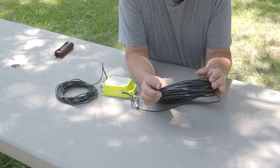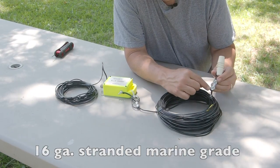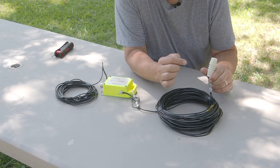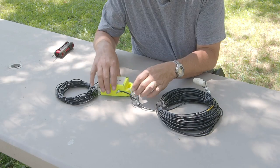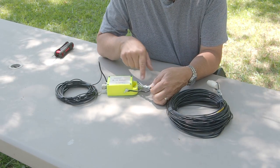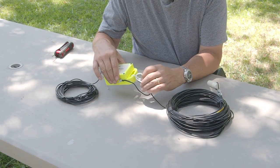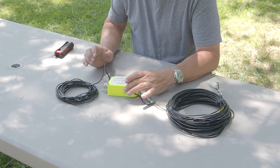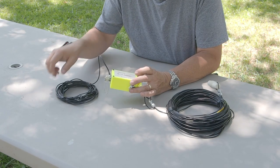Here's what we've got: 124 feet 6 inches of wire. I've added a little clip here that I picked up at Home Depot and an insulator from a junk box — that's the antenna section. It's tied in here with another clip from Home Depot with a little saddle bracket, and I've used a zip tie for strain relief. It's hooked up to the antenna side of the transformer. On the back side we've got a PL-259 and a ground.